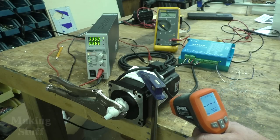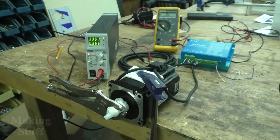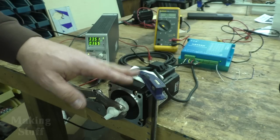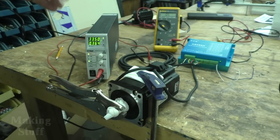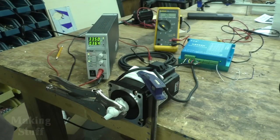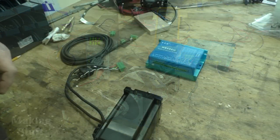Alright, let's do our final temperature reading — it has been on for about half an hour and it's 73 degrees Fahrenheit, so it only went up a couple of degrees. That's not a rigorous test since I'd want to put it under a real load, but I do know these closed loop motors run much cooler than open loop. For half an hour at 365 milliamps, I'm sure an open loop motor would be a lot warmer than just a couple of degrees.